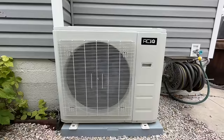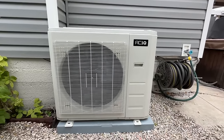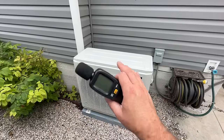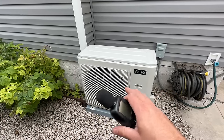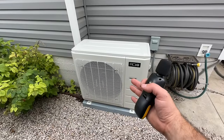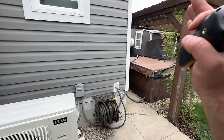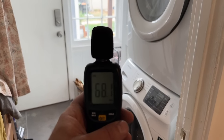I can run a longer extension cord and put the generator behind the shed or garage, and you'll hardly even tell it's running — a fantastic option in an emergency. We turned the heat pump on a second time in low idle mode and it handles it no problem. With the dryer and the heat pump running together, we did have to switch to high idle mode, which is understandable since the dryer pulls a lot of amps compared to the soft start the heat pump has built in. Inside the home, we're getting just 54 decibels.